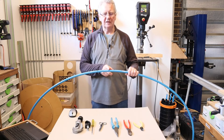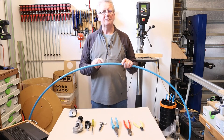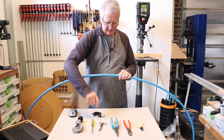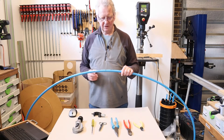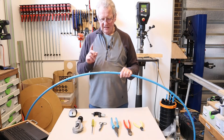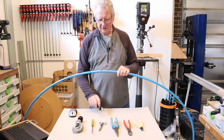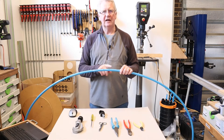This is the centre point of where we're going to remove the sheath. I've gone back 1.9 metres in either direction, so we're going to remove a total of 3.8 metres of sheath. I've marked out a part in the centre where we're going to make a test cut. It's important to make the test cut in the middle to make sure the CabiFix tool is set to the right depth, because if it's too deep and we go through and damage the core at one of the ends, it would be really difficult to recover. It's best to start with the depth set on the shallower side and then increase gradually using the screwdriver until we get to the right depth setting.